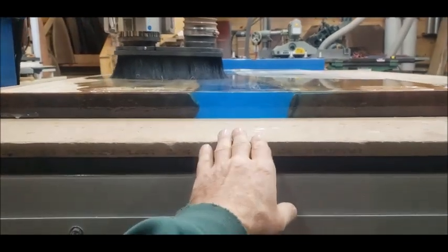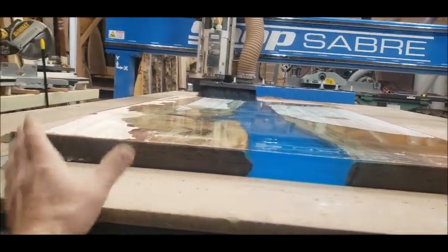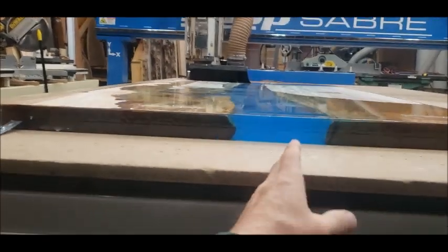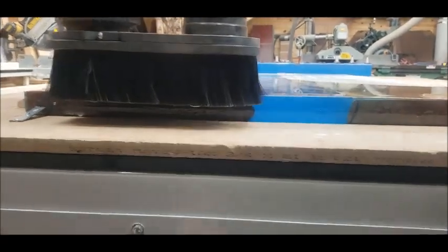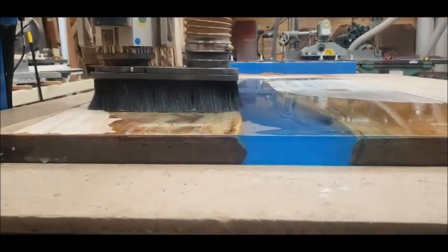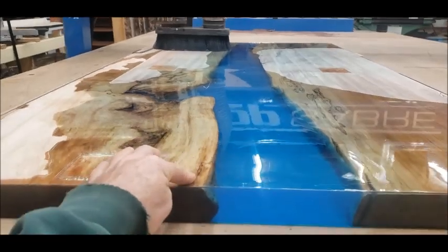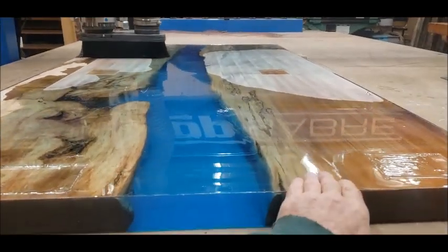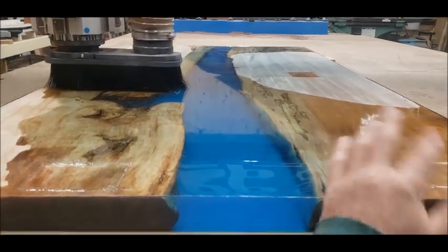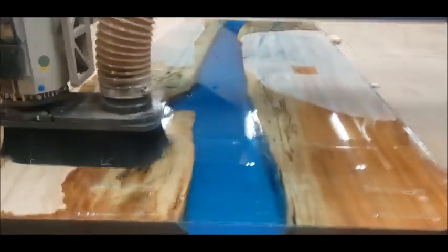When it's that badly warped, you either have to design a base to somehow suck that table back flat and do it all by hand - there's no way you can do it on a CNC - or we've had to cut right down the middle. That happened on a table where there were three separate boards with a board, a little river, a board, a little river, and a board. It bowed up so bad we cut it in half, flattened both sides, then glued it back together flat and it stayed flat. Tables where guys use just a little bead of silicone to keep epoxy from spilling over seem to stay a lot flatter, because you don't have that massive amount of epoxy across the top.